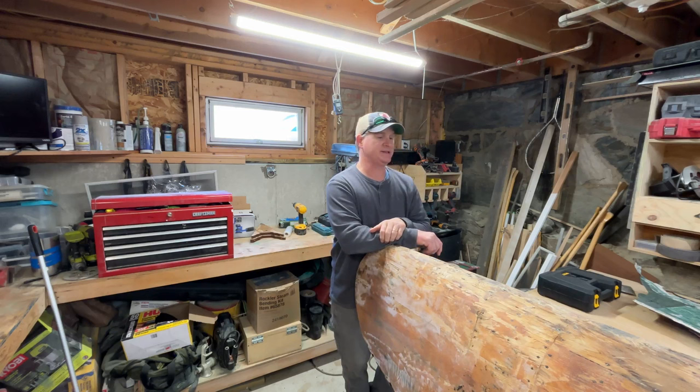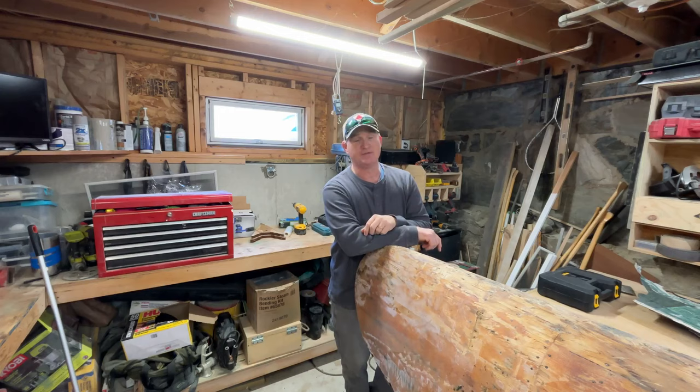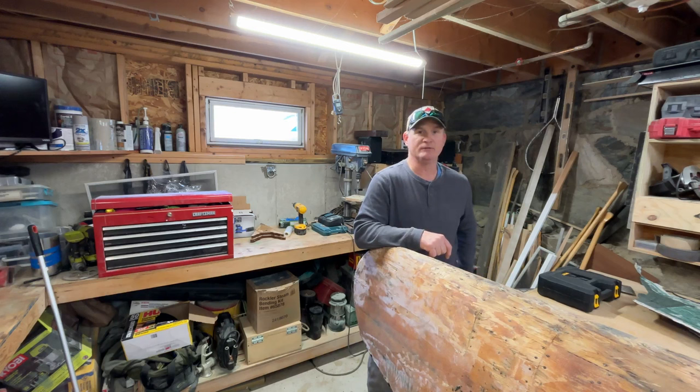The rest of it's in pretty decent shape. Because the owner wants to restore this canoe by salvaging as much of the original wood as possible, there's going to be some epoxy repairs to the forward end, but back aft on the stern there's going to be full planking replacement. You just can't do anything with it — it's gone. It came off with the fiberglass and it's just dry rotted and rotted through.